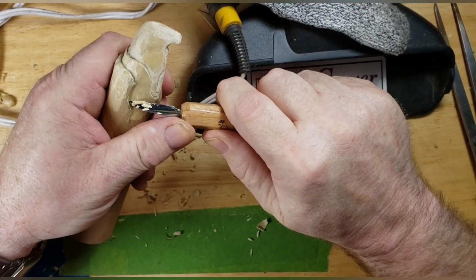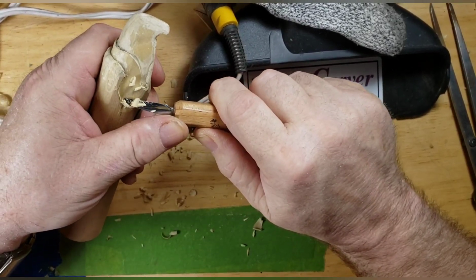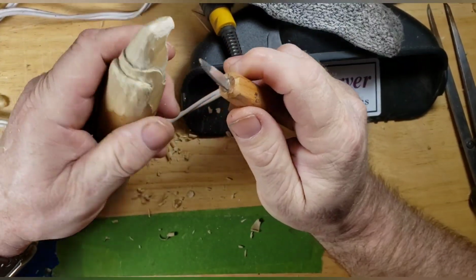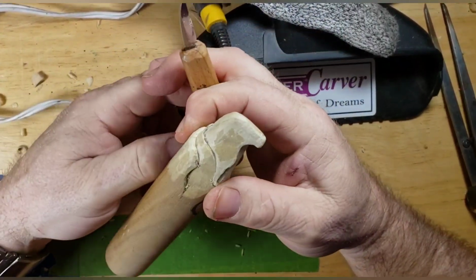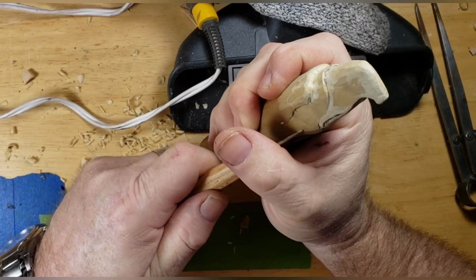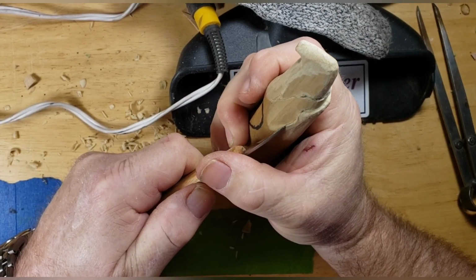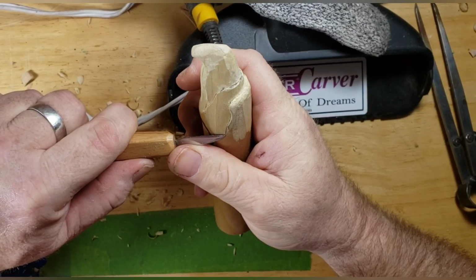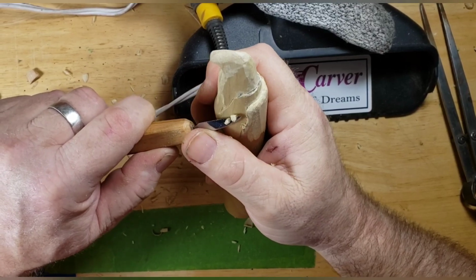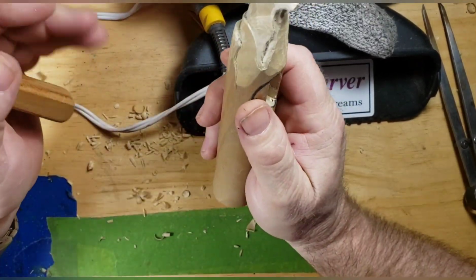Well, what kind of measurement is a smidge, Rob? A smidge is smaller than a pinch. Okay, yeah, if we were talking in machinist terms, a smidge would be like maybe 10 thousandths of an inch, which a human hair is 7.5 thousandths. And a matchbook cover is 15 thousandths, but who can find matchbook covers anymore? A dollar bill is about 10 thousandths thick. So if you hear me say a smidge, I'm talking about the thickness of a dollar bill or a human hair.